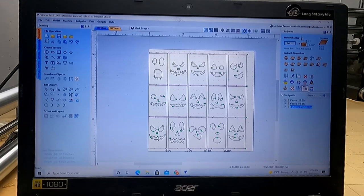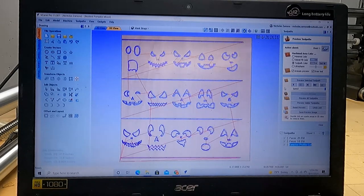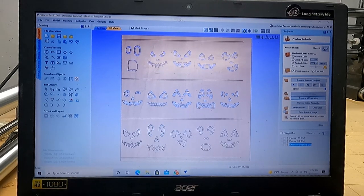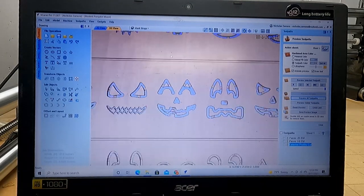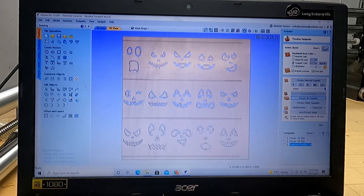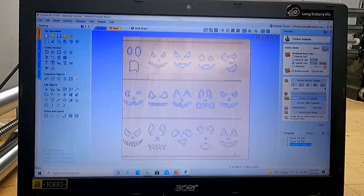Yeah, so if you look at the preview for this, we'll go into preview toolpaths. So I'll reset it, and then I'll preview all toolpaths. So this is all of them being run out, and you see how it thinks it's all one piece of material, but you can also tell with that profile cut, see it did not go all the way through. I don't really care, I just come and clean it up later, but yes, this is one picket here, one picket there, one picket there. This has no idea about it, so your placement of these is very critical. You have to place it correctly.